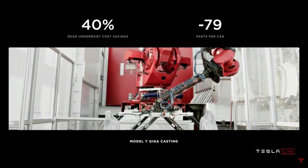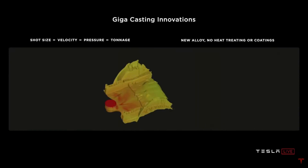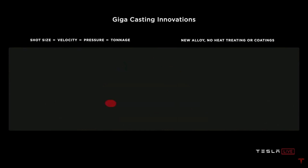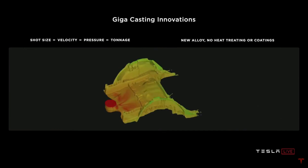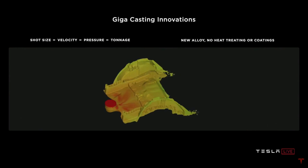In order to do this, we actually had to develop our own alloy because we wanted a high-strength casting alloy that did not require coatings or heat treatment. This is a big deal for castings, especially with a large casting. If you heat treat it afterwards, it tends to deform — it kind of does this potato chip thing. So it's very hard to keep a large casting in its shape. There was no alloy that existed that could do this, so we developed our own alloy — a special alloy of aluminum that has high strength without heat treat and is very castable. That's a great achievement of our materials team.